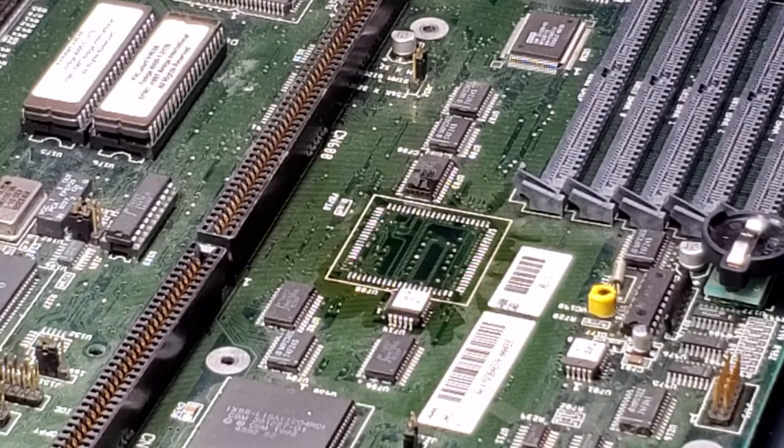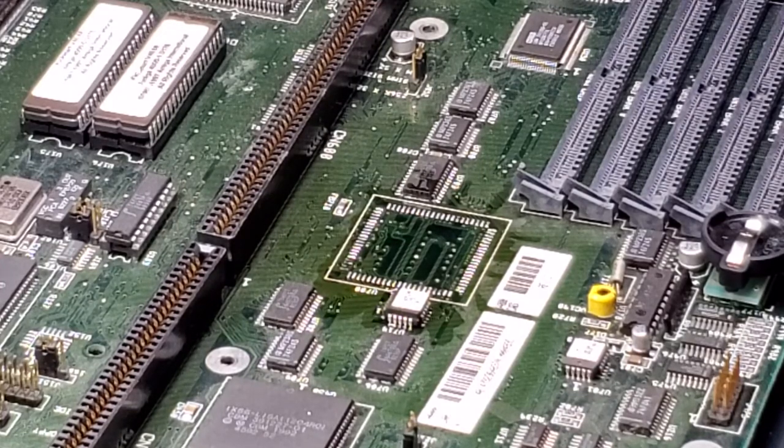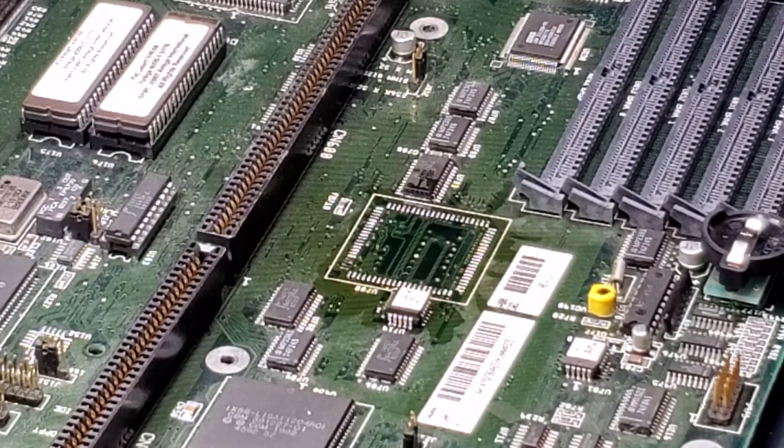And that's basically it. That's how you take off a surface mount chip. You don't want to rush it. Don't force it. The preheater is really part of the secret. It allows you to keep the heat on as minimal time as possible. And it doesn't require it to go quite as far. So I only had to go up 76 degrees from where the board was sitting at.